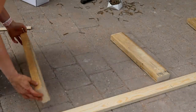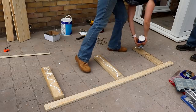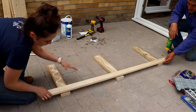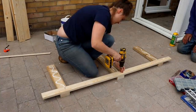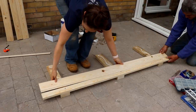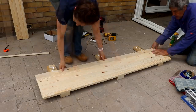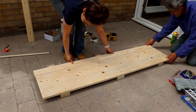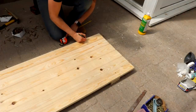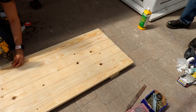After making sure the best sides of the spars were facing down, I added some exterior glue on top and lined them up with the pencil marks on the first match board piece and added a screw — but only one per piece first. Once that was fixed, I continued slotting in the rest of the wood, gently tapping as I went, making sure the nice sides were facing upwards until I got to the end one. I added more six-inch marks to the top and bottom of the last piece and that centre mark, then made sure they were all in line with the spars, adding another screw in each.